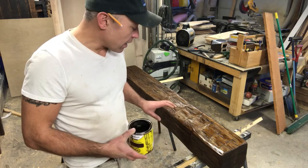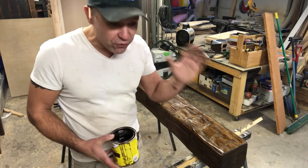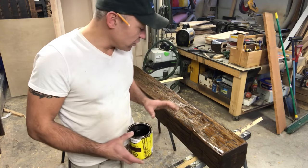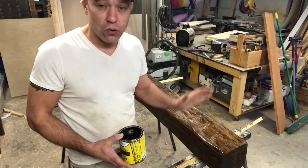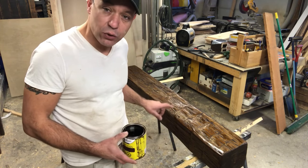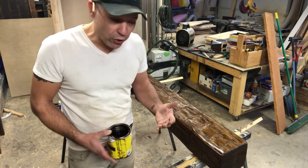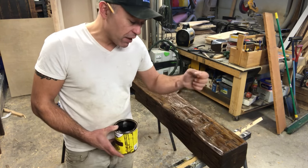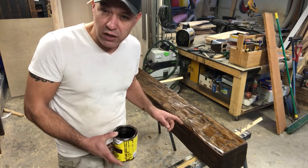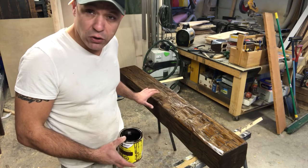With reclaimed wood you have to understand that not every piece is the same — every single piece is always different depending on the age of the wood and the species of the wood, so it's gonna adhere to stain differently. This one is a hardwood first and foremost, and it's showing a lot of grain, which is beautiful, but this client wants a dark beam so we might have to do a second coat of stain. I usually like to use a paintbrush or rag when staining — I don't like to use a sprayer. I like to actually get in there with the brush or rag to penetrate the wood rather than just spraying across the top. We might do a second coat, and we'll be back tomorrow when we do the dead flat varnish.